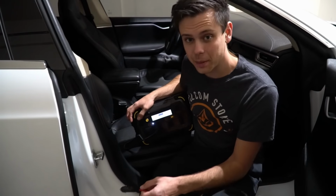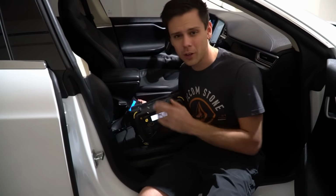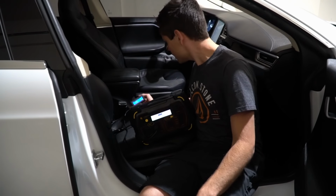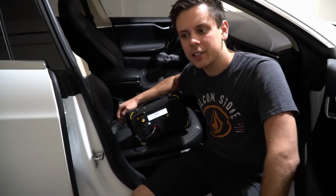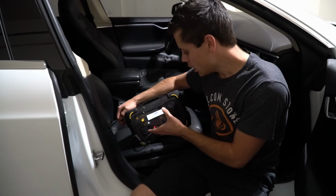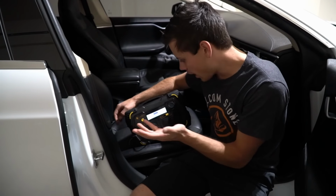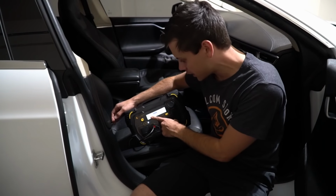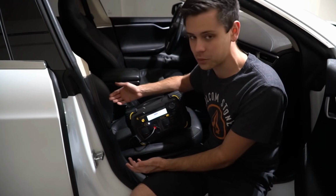So the charging speed has not increased, so I'm going to check what the voltage is at the receptacle. We have 14.2 volts. So it should be charging faster. Oh, I think I know why. It's because of this chemistry and the charge circuitry. You need that voltage to be higher with the MPPT. But we don't have higher, so I think this is the max we can get. But yeah, the max I can get right now is 58 to 65 watts, which isn't that great.